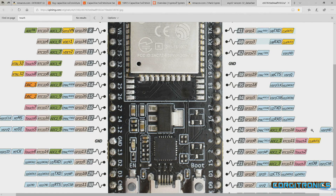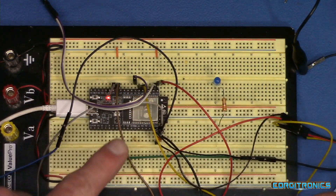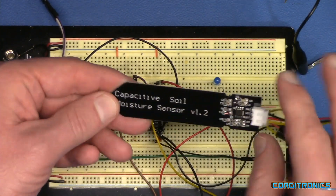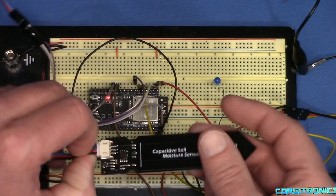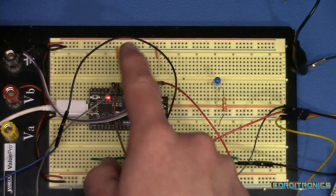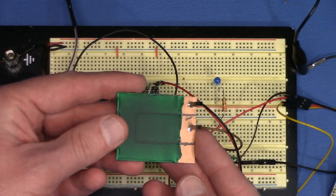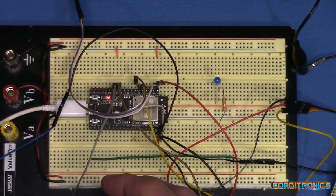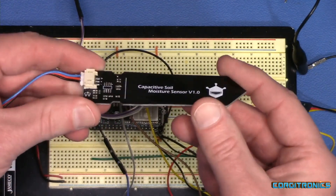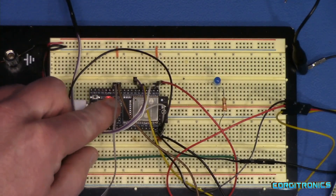So let's try using those and see if we can use them as a water sensor. We have a bunch of stuff hooked up to this ESP32 dev board. The cheap AliExpress one is hooked up to pin 35, and the DFRobot sensor is hooked up to analog input on pin 32. My cheap homemade board is hooked up to touch sense on pin 14, and the old DFRobot one with components stripped off is hooked up to touch sense on pin 12.